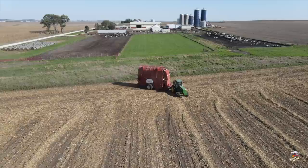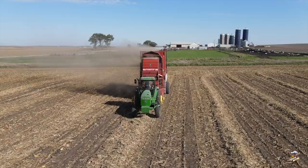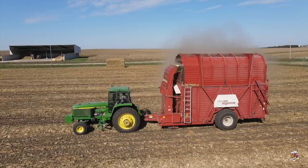The Model 4760 came with a 1,000 RPM PTO only. You could get these with three or four remotes. Depending on the transmission, the quad range tractors could put out a little over 35 gallons per minute hydraulic flow, and the power shift was 31.6 gallons per minute. Top speed in these tractors was just under 20 miles per hour.